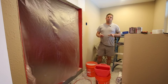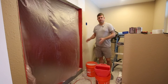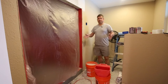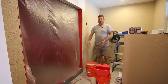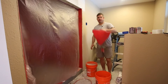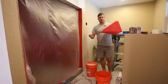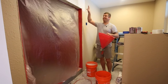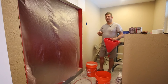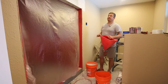I'm going to texture the sheetrock up here. First I need to take my mud that I've mixed up — this is standard ready-mix mud. You dump a box into a bucket; they come in about $6 boxes. You add about a gallon and a half of water and mix vigorously with an appropriate mixer. Then I take a second bucket and fill up my texture machine's hopper. The way it works is: an air hose attaches, air comes in and sprays out, and through the venturi effect it pulls texture with it. The tip size determines what you get on the wall.